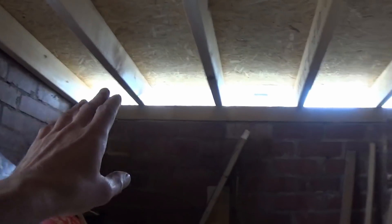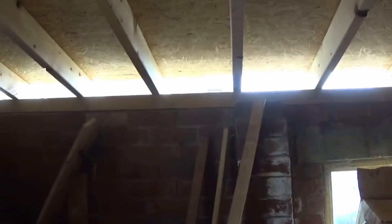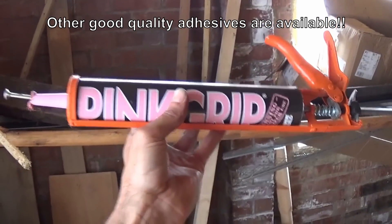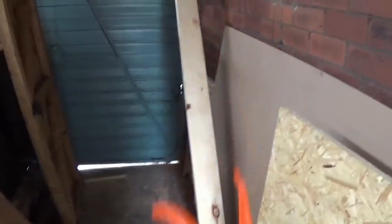Do exactly the same on the other side. This wall plate we've put over there, which is the same piece of timber, sits along the top of the wall. We use bolts again into the top of the brick wall - I think we used about five along the way. We also used a load of grip fill, actually called pink grip. It's very much like grip fill but I find this product a lot better and it's a few pence cheaper. It also doesn't harm to use this pink grip in other places where you want a little bit of extra adhesion as well as your nails.